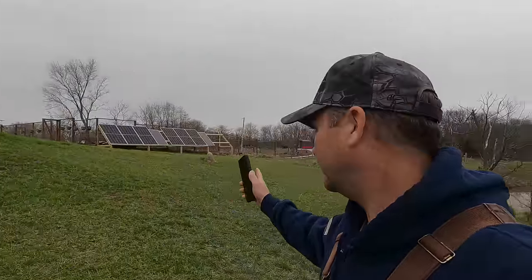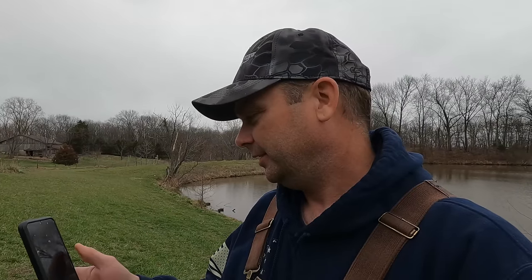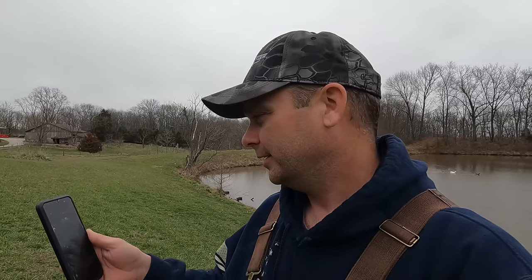The off-grid panel has been powered up by the solar panels and the EcoFlow for four days now. We started on Saturday; this is Wednesday at noon, and it is a very cloudy day. Yesterday was cloudy too, but the sun came out for just a couple hours and was enough to top everything off. But today it's afternoon and one of them is only back up to 41%, taking in 273 watts, and it says it's going to take eight hours and 44 minutes to charge — and there's not that much sunlight left in the day. Basically, after four days of running, we're at the point where it's not going to fully charge on solar, so we actually need to be able to charge it off the grid or switch the panel back to the grid.